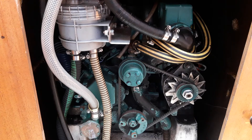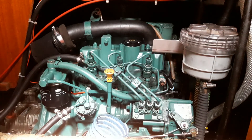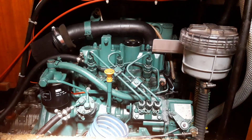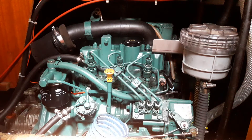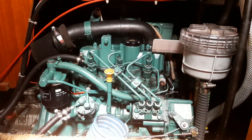The only other thing you might want to check is the oil level. We'll move into the starboard aft cabin where there is an access panel just behind the door. This large box hides the back and starboard side of the engine, and by undoing the slip bolt you can slide it backwards to reveal the starboard side and aft end of the engine. The yellow cap here is the oil dipstick. Just like a car, it has a high mark and a low mark, and the oil level should be somewhere between the two. If it needs topping up, there is a bottle of oil in the cockpit locker. Please add small amounts then recheck the level, as these engines have a very small sump and it's very easy to put too much oil in.